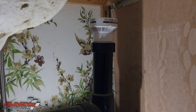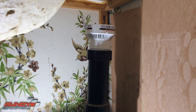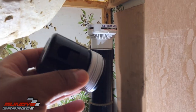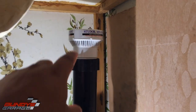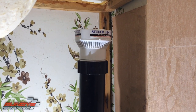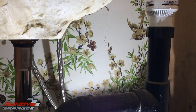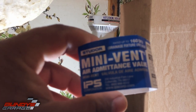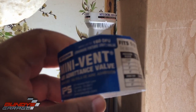It's been about 15 hours and the smell is gone. It's the next day and I replaced this old black one with the new Studor. Link in the description. Yeah, it fixed the problem. The awful smell is all gone. Air admittance valve — just change out your air admittance valve and you'll be good to go.